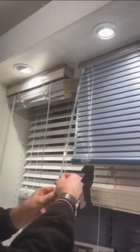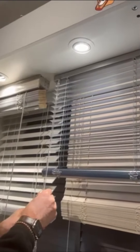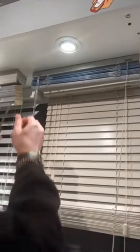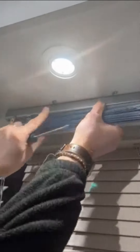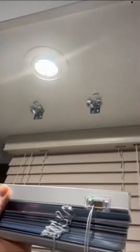To remove an aluminium venetian blind, first turn the louvers so that they're horizontal, then lift the blind up to the top and lock it. Then use a screwdriver to lever out the bracket slightly — or both of them — and then pull them loose. Then lift the blind backwards and then up, and it'll come away.